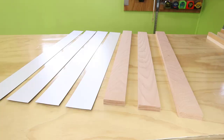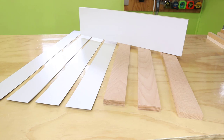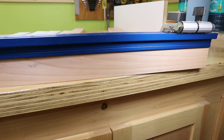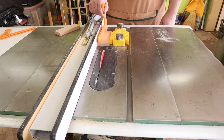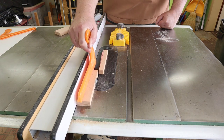Now I'll cut some more laminate so I can cover the two rails. Here's the output with laminate cut for two rails, and here are the two beech rails plus a spare. I should also note that we still have the slider base piece which is six inches wide — we need two pieces for the slider assembly. I temporarily put the T-slot and Kreg stop onto the fence and measure the width that's left, then transfer that measurement to the table saw and run the two blocks through.